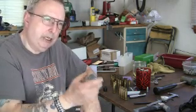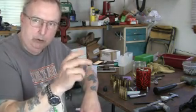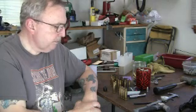A hard alloy with a gas check is good when that bullet is right to the groove diameter, or actually 1/1000, 2/1000 over. Then it goes good, it really don't lead. Like in my Carcano rifles, you get very, very little itty bits of leading when you look with the bore scope, way in the grooves, but nothing to where when you run a patch or something down there, lumps of it come out. And I'm using a very light, mild load with those cast bullets. So there may be something, this is too fast.